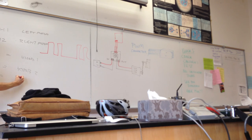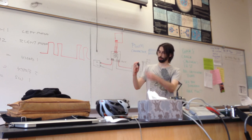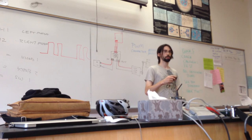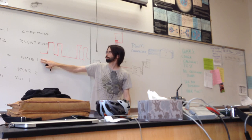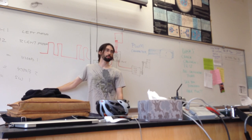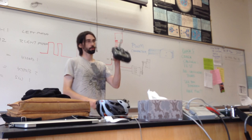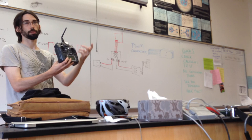Channel five equals switch one. Then what you will have to do is go: in tank drive mode, channel one is controlling the left motor, so I plug channel one of my receiver into the left motor controller. Channel two of the receiver goes to the right motor controller. Channel three can be anything you build onto your robot — say, an arm that needs to rise up and down. You plug the motor controller for that arm into channel three, and then you know that when you turn this knob, it moves the arm up and down.